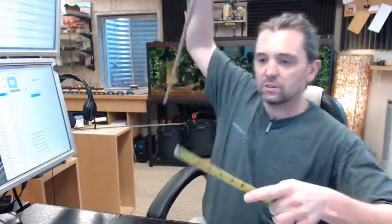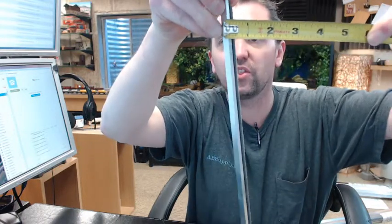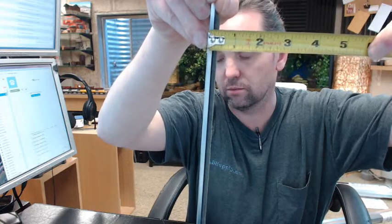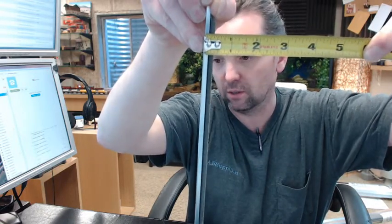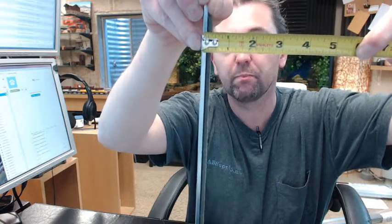This material is 13/32" wide, so it's going to be basically 7/16", slightly less. The thickness of the extrusion itself is 5/32", so just heavy of an eighth. And you've got a projection of the pile at 3/16", so pretty close to 3/8" overall.